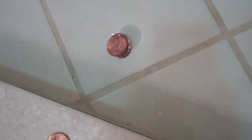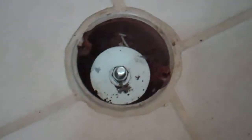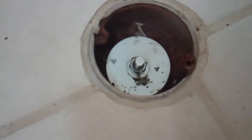If I come back in 3 hours and it's lower, then my water's coming out somewhere. If you can just look at my little drain plug, I don't see any of the soot or whatever running around the water. It's not running down the drain, so it's sealed. And now we're going to see, right, if that water will stay in the pan. Now they say a true pan test will take 24 hours. You should let it sit there a day. So we'll come back later and show you what happened.